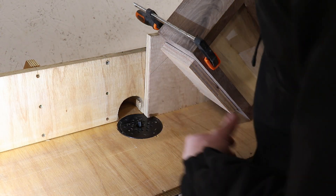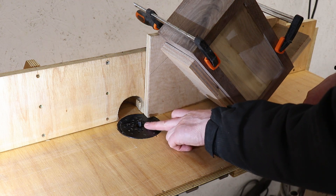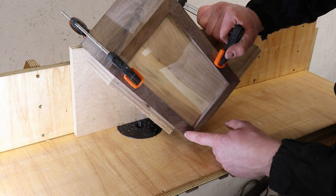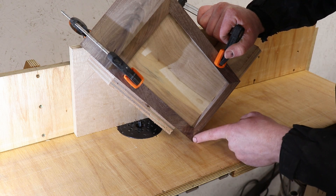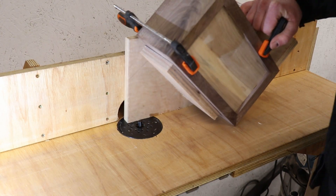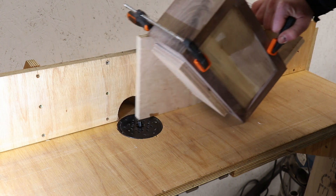We're all set up in the jig and it's very simple — it just holds the box at a 45 degree angle to the table. There's the dovetail bit sticking up, so the flat part goes against the fence and I just run that straight through. That will cut my dovetail mitre spline straight through my 90 degree corner at a 45 degree angle. It'll be slow enough — I'll have to run it through, flip the box, clamp it, flip the box, clamp it — that kind of thing. But that's how it works, nice and simple.